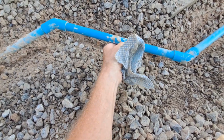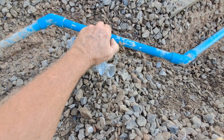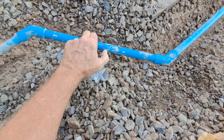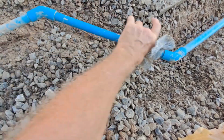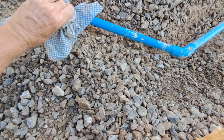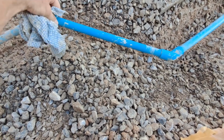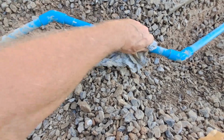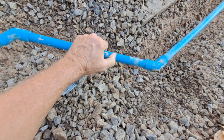a split pipe seems to be the most unlikely thing in my view, because I would expect it to make the recycling happen a lot more often than every 20 minutes and be very much more visible. Whereas a joint can be a very, very weepy sort of leak that takes ages to build up and reduce the pressure in the pipe.